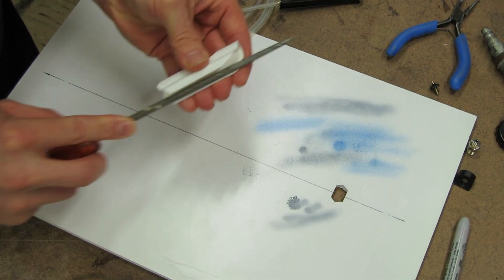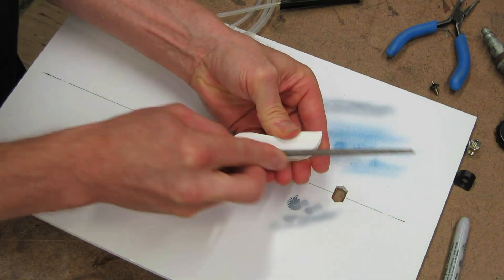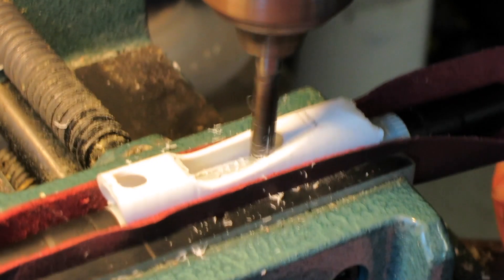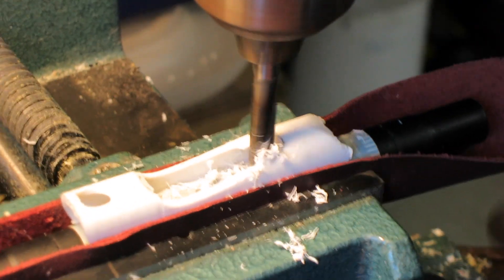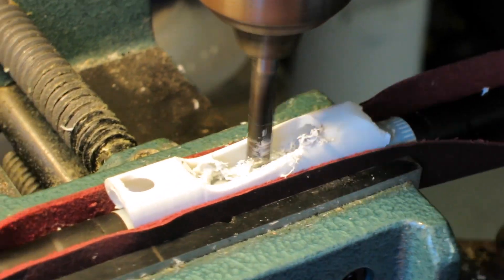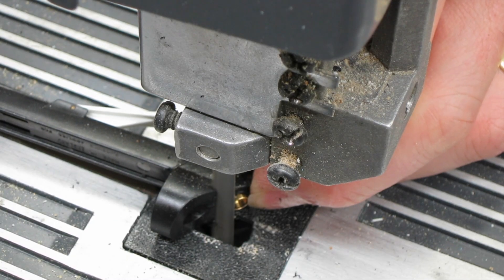So this is what I would call a low-level prototype. It's kind of rough. It needs some cleanup and it needs a little bit of work still. So we take it over to the mill and I'm going to mill out some additional material — something that was just too big of a pain or too much guesswork involved in CAD because we're adapting it to something. So I'm going to machine it out to give me the clearance for the lever to move up and down.